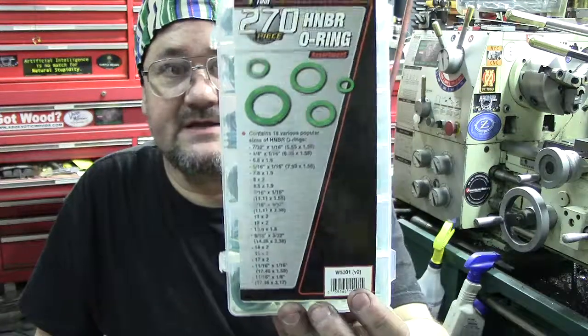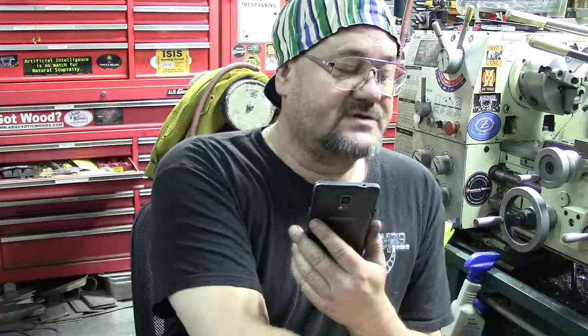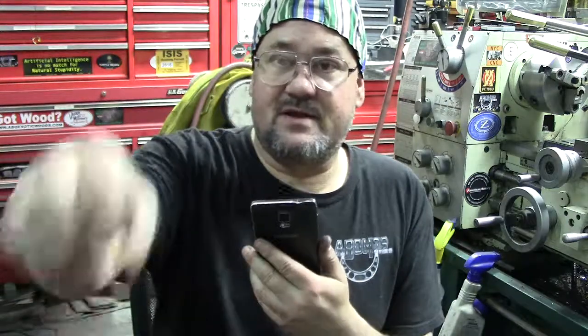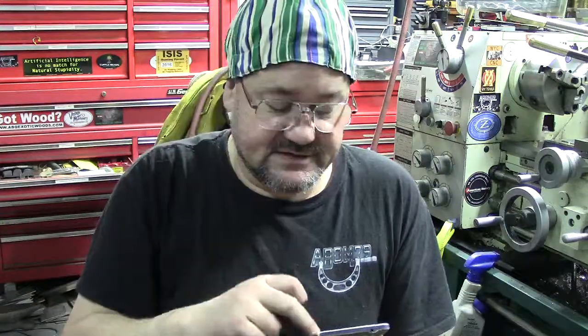So when I was down there looking at stuff, they had the green O-rings, called HNBR. Now, just so you guys are curious why I chose them: typically those are going to be used on an AC system. Again, this was built in 1962. They didn't have this back then, so I thought, okay, because I've got a lot of O-rings, not only there, but in where it fits up in the valve body, I thought, hey, we got O-rings that are specifically designed to be around oil and pressure and temperature changes. What you have in an AC, you got the same thing in a surface grinder. You have oils, hydraulic oils, and yes, they'll work with the hydraulic oil. No, they're not going to eat up, because there is oil in an AC system. They're under pressure, and there's also temperature changes, hot and cold cycles. So other O-rings have a tendency to, like what these did, but as far as I can tell, they're original from 1962. Let me just read you a little bit.